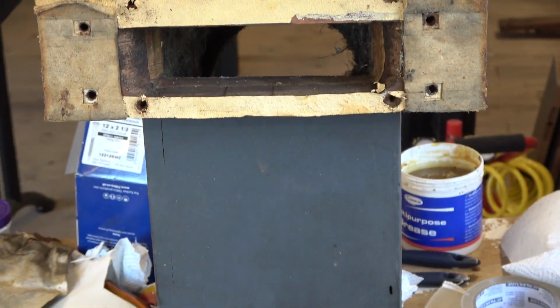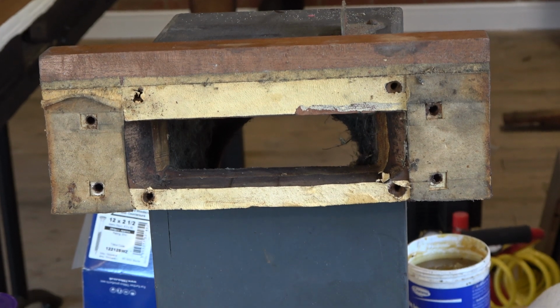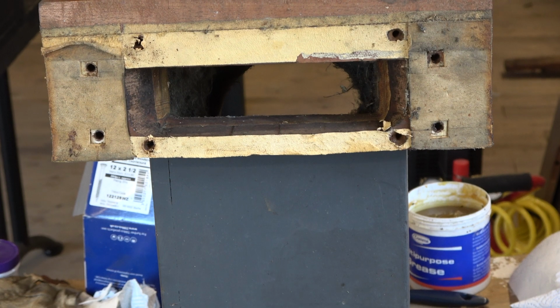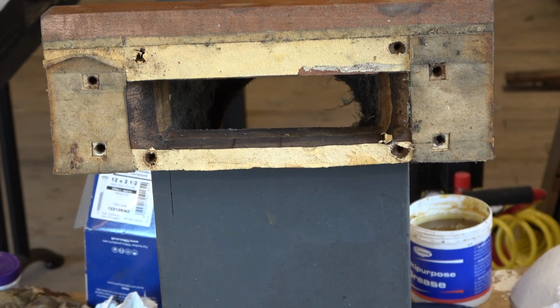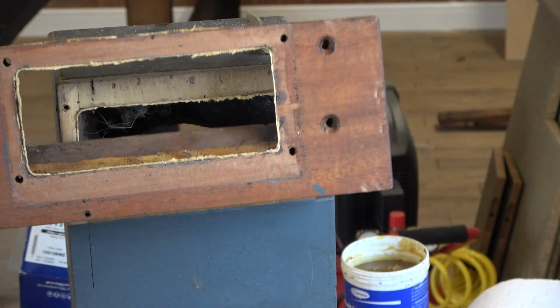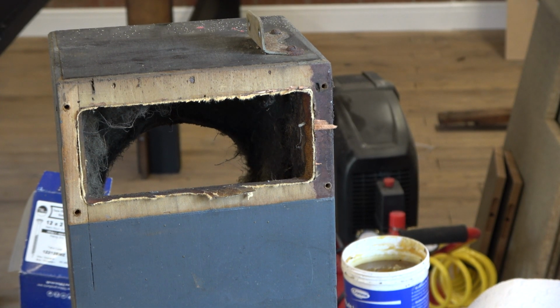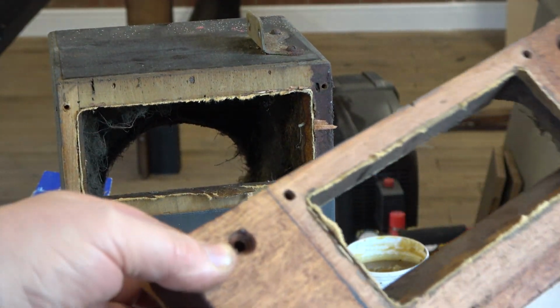So this would have gone on in the 1950s, so it's not like I'm altering something from 1864, because I'm not. But the thing about the kind of control valve I'll be doing is that you can see where its position is. You can't see where the position is on that, and the fact that it's an all-metal construction, often if it's in a church, they're going to be very damp environments, and exactly what's happened to that is going to happen, but it has failed in the shut position. But I will just add, it was working when we took the organ out. So we'll go back over to the chapel, and we'll start putting one together.